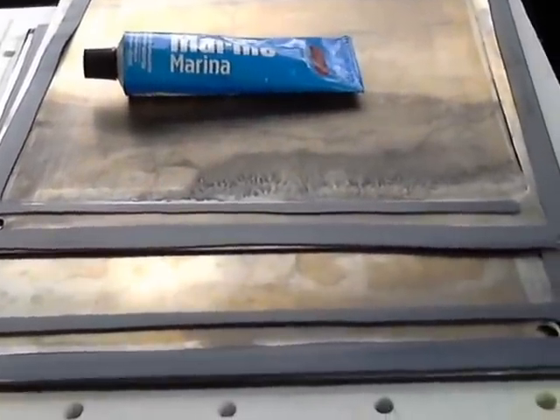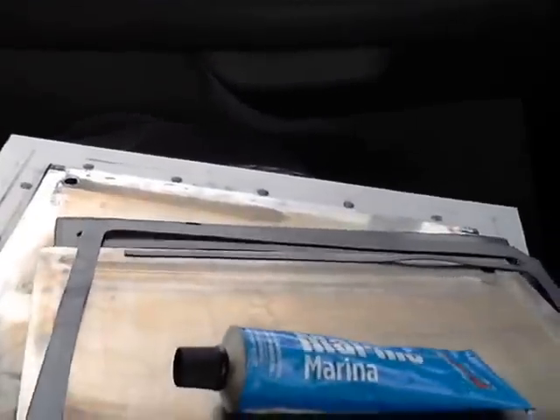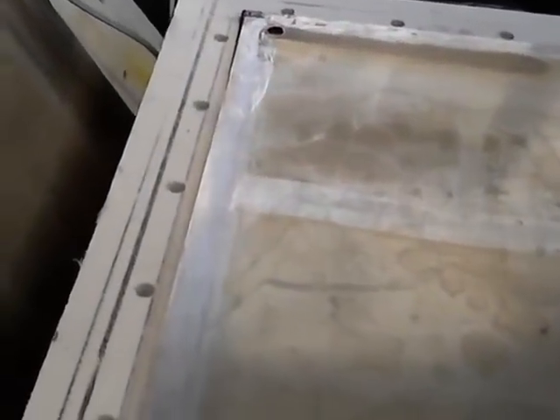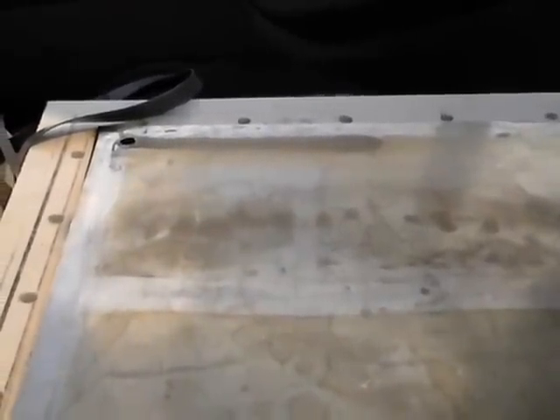Because of the sheer size of this, on the end plates — where a lot of guys will put on one or two connections — I actually have four connections: quarter inch tabs notched in on all four corners. Because of the way I'm running this and allowing the fluid to go all the way to the top, the current is conducting in from all the corners, and this has worked out really well.